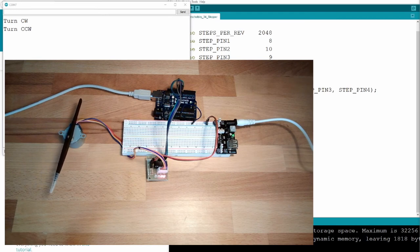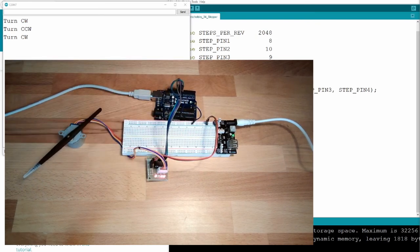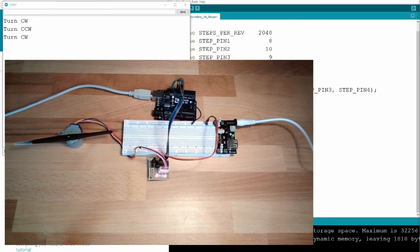That's what's really the difference between a stepper motor and a servo motor. If you remember, the servo motor does have some feedback. The servo motor will notice if it's losing steps and will correct this. The stepper motor, from its point of view, does not correct.